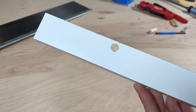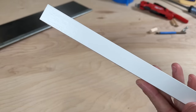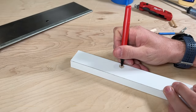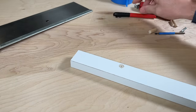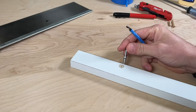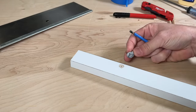Here's the finished product — a flush surface so that if another piece from your furniture kit sits against it, there's no issue with the dowel sticking out. Now mark the center point carefully. It's critical to get the hole in exactly the right spot, because cam screws need to perfectly align with the other piece of furniture where the cam nut will be set.